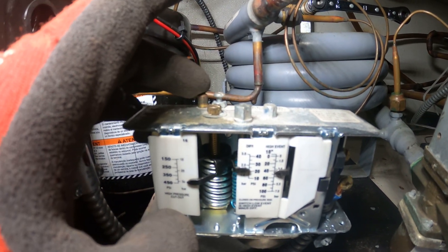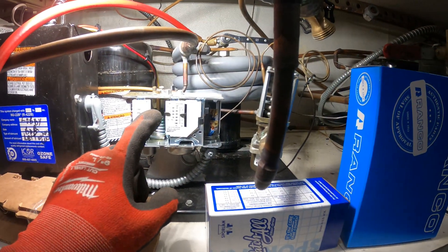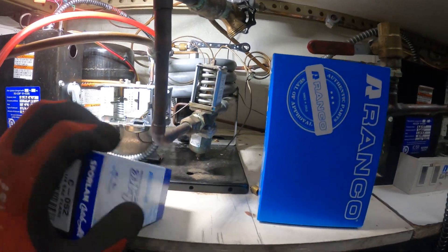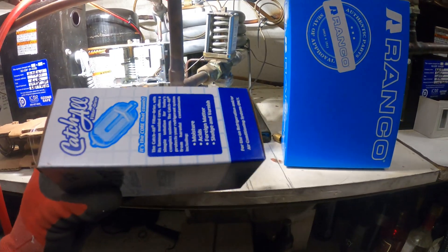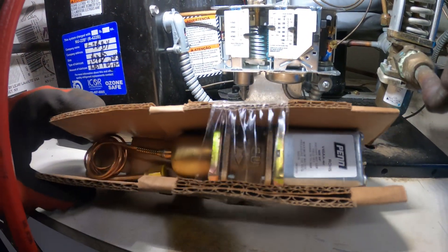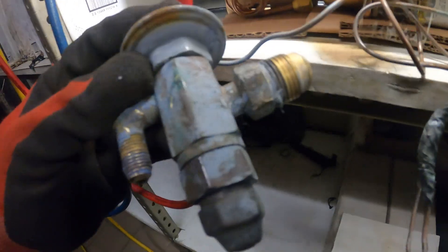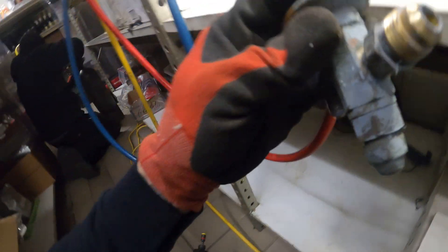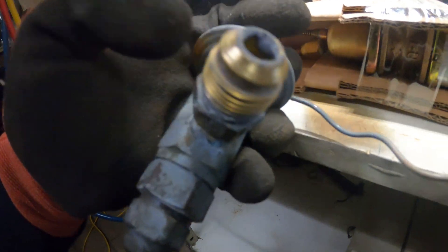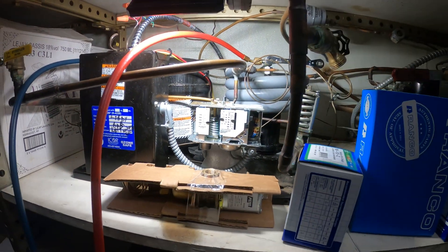This is a manual reset — this is the reset itself — and we're going with an automatic reset. I picked up that part. Here is the filter dryer; it's quarter inch but it is actually flared, so we have a quarter inch flare filter dryer. That's gonna be the last thing we put in — anytime you open up the system you want to change that filter dryer. Here is the water regulating valve we're going to replace. I already pulled out the expansion valve — look at all that leak lock, the blue stuff; it's even inside the pipe.